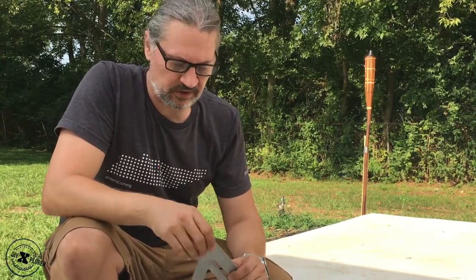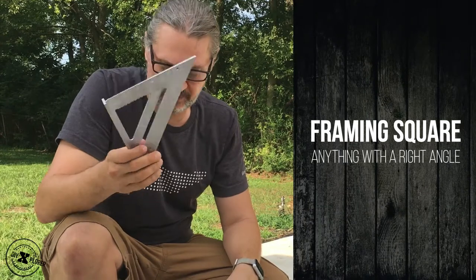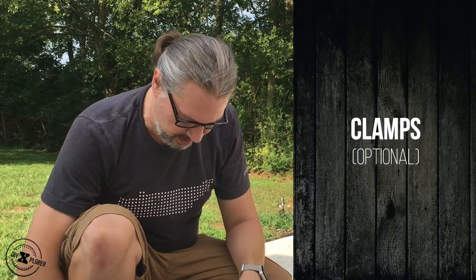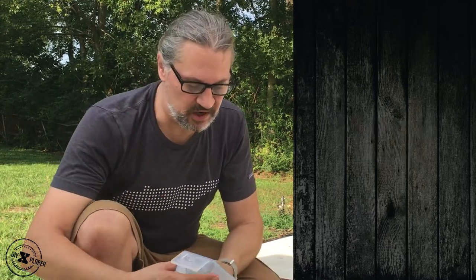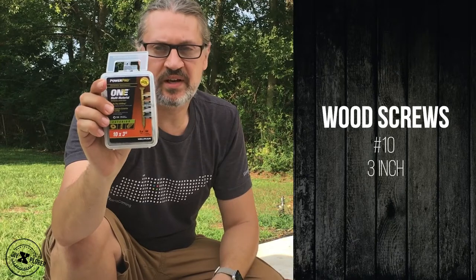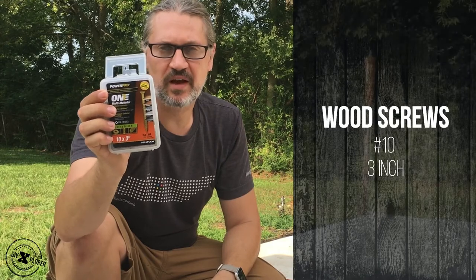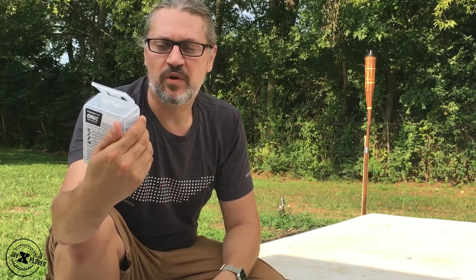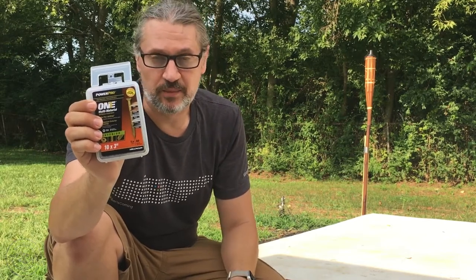Now we've got all of our wood cut. I've laid it out on the ground to show where every piece goes. The tools we're going to be using going forward: a standard framing square so everything is nice and square, some clamps to hold pieces in place while I glue and screw them in, wood glue of course — that's every DIYer's favorite — and some number 10 by 3 inch PowerPro multi-purpose screws. These are about $10 for a box. The thing I like most about these is that they're multi-material, so they'll do wood, masonry, metal, drywall, and plastic. I didn't need a whole lot of screws for this project, but now I've got screws for almost any other project going forward.